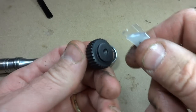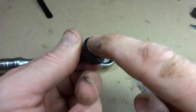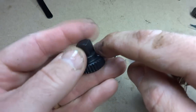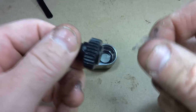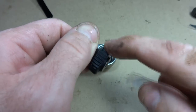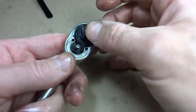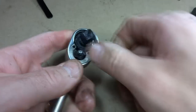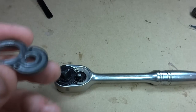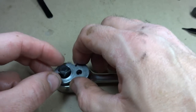I've got the new gear here, and I'm going to go ahead and lube this up really well with the Super Lube — some on the bottom, some around the top edge, just a thin coating, and a little bit on the teeth as well. This part is just going to fit right in here. Make sure it's all snug down in there. I've got the little plate here, and I'll put a little bit of Super Lube on this, and it's going to set down on there.